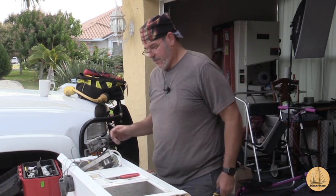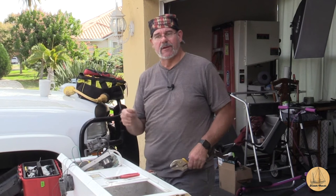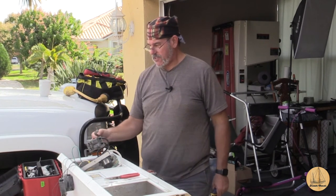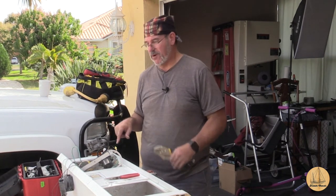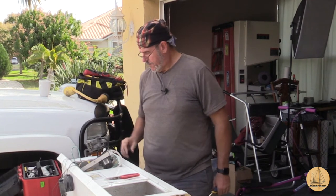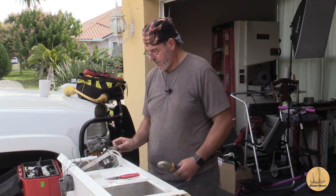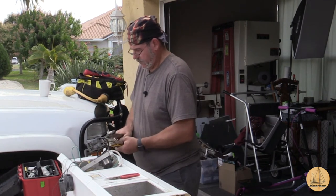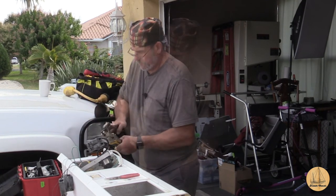I've been going through all the breakers, testing everything, cleaning up connections, and pulling off a bunch of little tag wires — over the years somebody had broken a wire, replaced an outlet, and just left the old wire there cut off at the terminal block. I've been cleaning all those up, and now I'm cleaning up the connections that go between the input line loads to the actual bus bar. I used a little wire wheel on the end of a drill and it's making a big difference cleaning up the ends where they make contact with the bus bar. I have one stripped screw that I'm working on getting out.